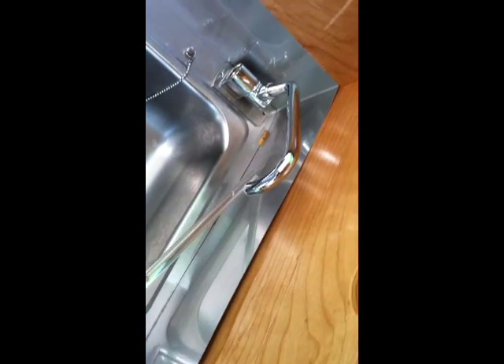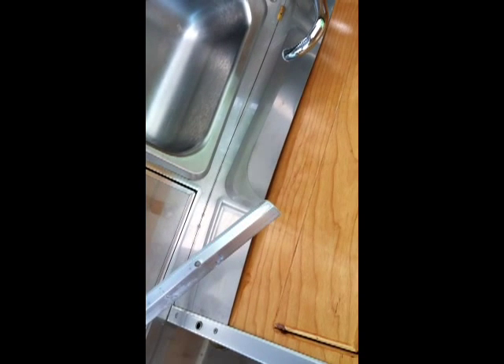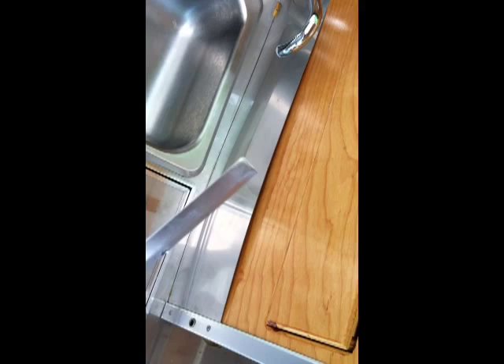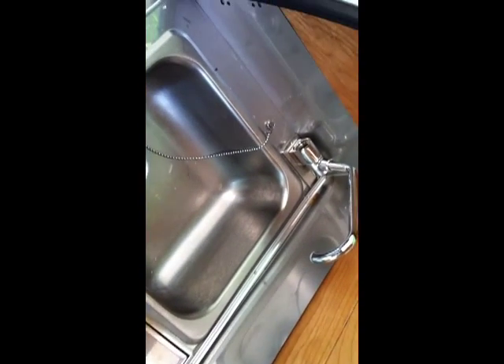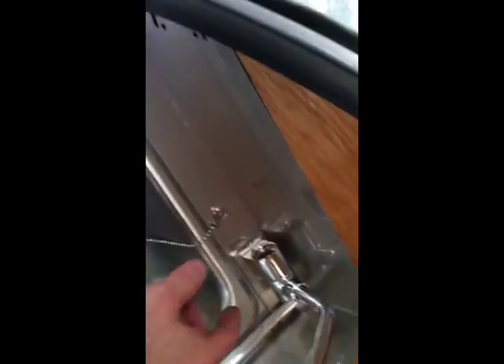One of the more difficult things to do is fit the back trim right here, because it's going to make the holes not line up with the original holes. What you need to do is trim off a bit - what I did is I took a hacksaw, trimmed off a little bit, and then took sandpaper and kept rubbing it until it fit nicely in that section. You just have to remove metal until it fits - hacksaw the big portion and then fit with sandpaper. Really simple. I'm about to seal everything up - it's messy no matter what you do. You also have to take apart the sink to have access to the screws in order to mount it.